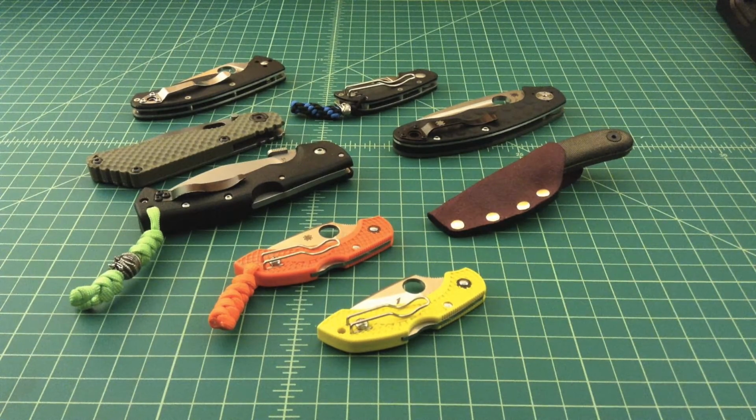So some of the early steels that we had were high carbon steels, right before stainless came out, and before the modern stainlesses. And one of the things that makes carbon steel still really popular in camping or harder use tools, like an axe or big chopper knives, is that it has the ability to flex. So it's more forgiving when lateral tension or torsion is applied to the knife. It'll still chip and break, but it's less brittle and less likely to break.